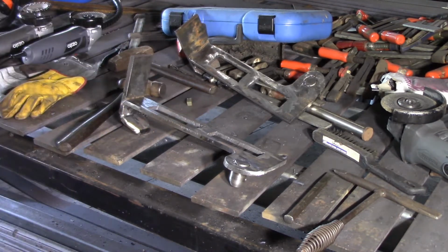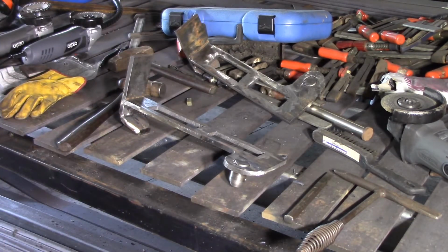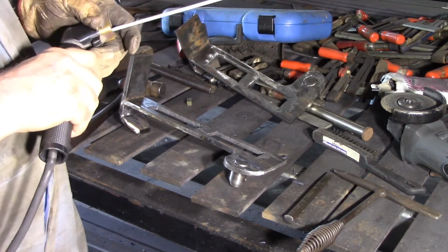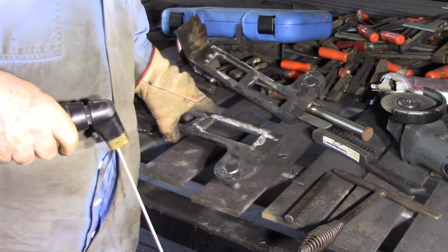I think it must be tool steel, and it work hardens because it is a shocker. So anyway, I had to cut some mild steel or some stuff that I knew what sort of steel it was, and remake them. So I'm back to the point now where I'm about to weld them. And because they're holding the bucket on, I'm going to weld them with some 7018 rod. It's 2.5mm, so they can get down in the gap that I've left there.